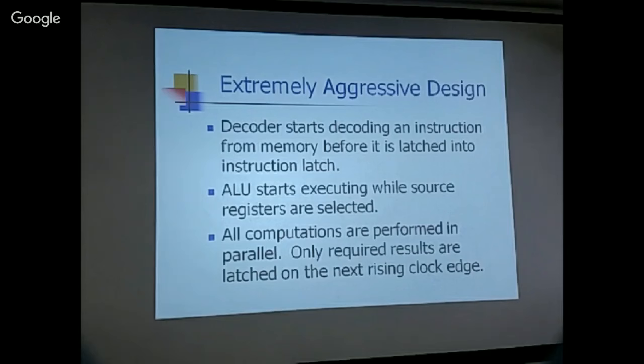Yeah, I prefer the design of RAM memory as asynchronous memory, where you can put an address anytime onto the address bus, and then the data will flow out of the data port. And it's just that on the clock edge, you latch the data that you want. But in most of the designs, Xilinx and all the others, they all prefer to have an edge to latch the address first. And once the address is latched, then the data will be available. So this is the synchronous design, which I don't think is the correct way to do a good design. I think asynchronous memory design is much preferred.